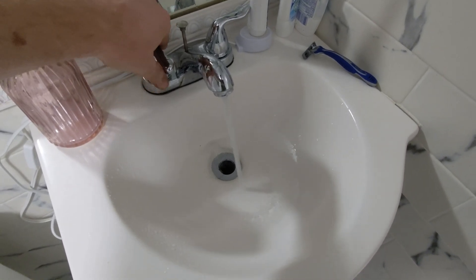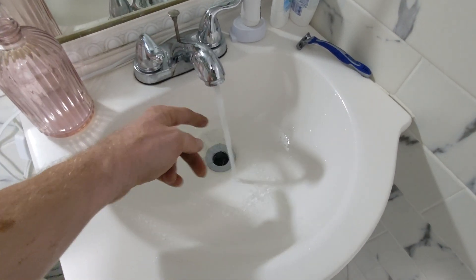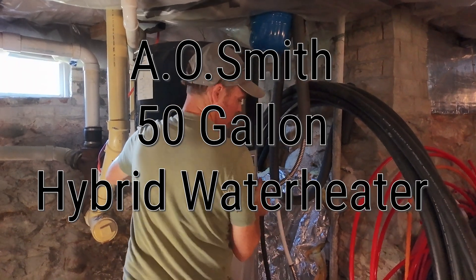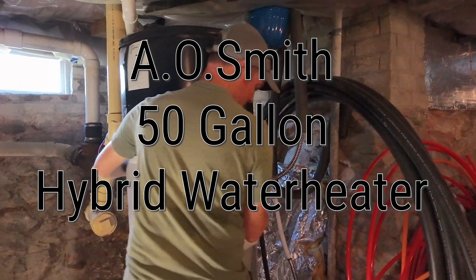Look at this — fresh hot water, right? Not so much. Smells like rotten eggs. There's something lurking in the hot water tank: it's sulfide buildup. The sacrificial anode is decayed and it needs to be replaced. That buildup happened for us in the past four years with really hard water.